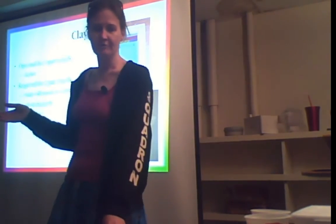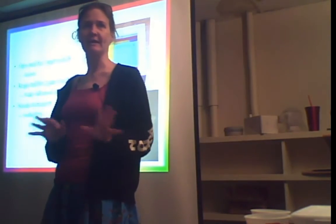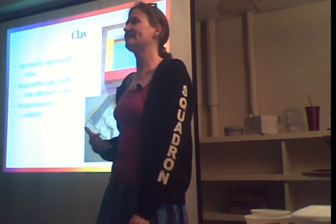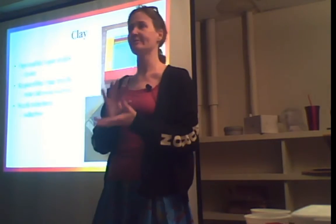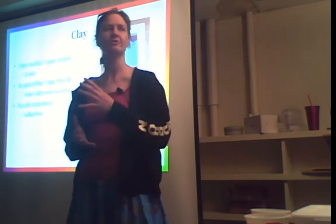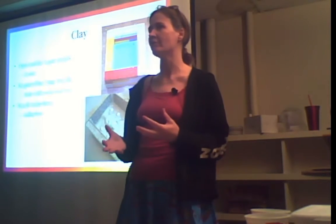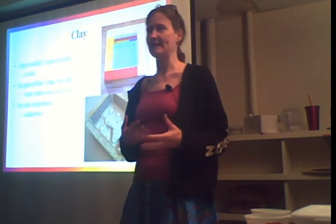I'm going to demonstrate the most simple version of this — I'll start at the bottom and scaffold it up. I'm going to do a one-part mold where I just pour it, let it go, and it's done. If you want to cast something 360 degrees around, like a keycap, joystick bay, or button, you'd want to do a two-part mold, which is a bit harder.